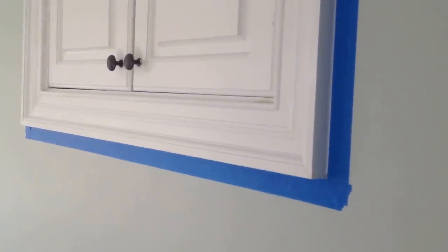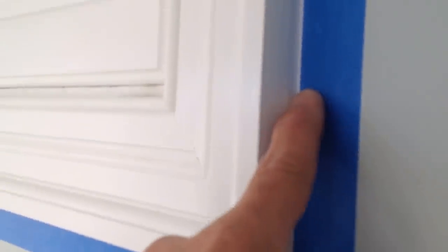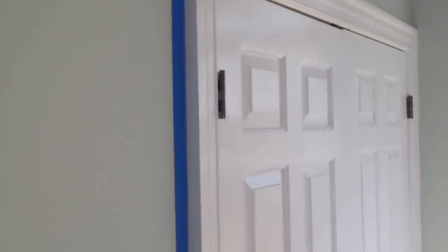The reason why I tape is I'll be able to see where there's problems in the actual trim itself. I haven't done any trim work yet — this is just staging the trim work. When I get ready to paint, I know for a fact that when I start painting this trim I also have an exact line. I can see that real slight bit of bronze in there — I don't want that to show, so I want that painted, but I'm not going to freehand it. Another attention to detail thing: on top of these casings for doors and windows, nobody caulks up there and nobody paints up there. I caulked the top edge of this thing.